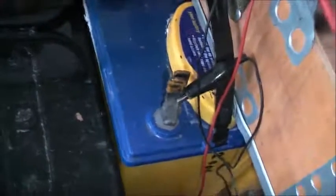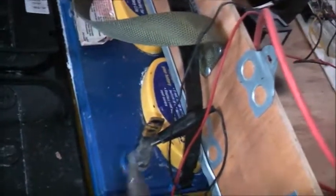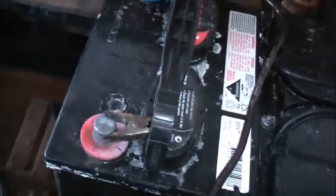Safety first. Discharge. It's gone down to 10 amps now, so this battery is the weakest. That's only got about 8 volts left in it. I probably haven't reformed it properly. Because I said earlier, when doing the Alum conversion, the condition of the battery internally is everything. So that one there still cranks over a lawnmower. So don't let your battery get any weaker than that if you want to use it for this purpose.